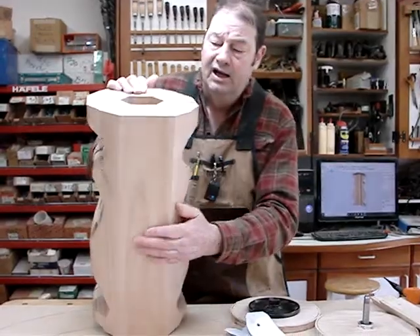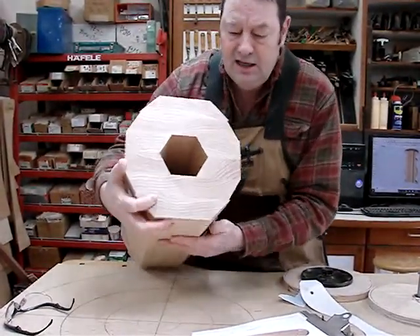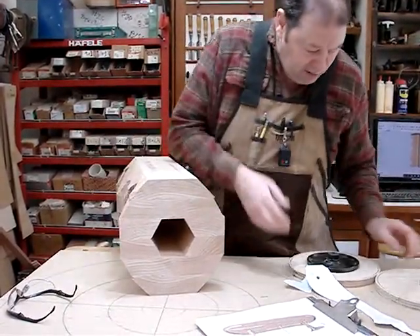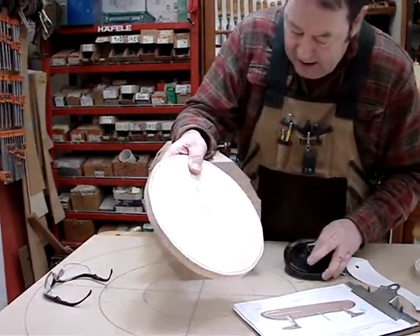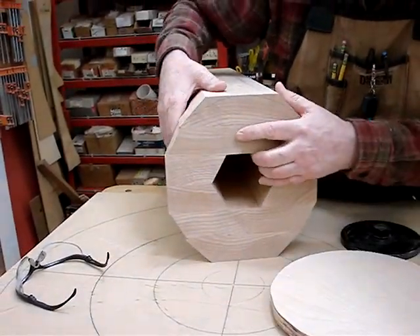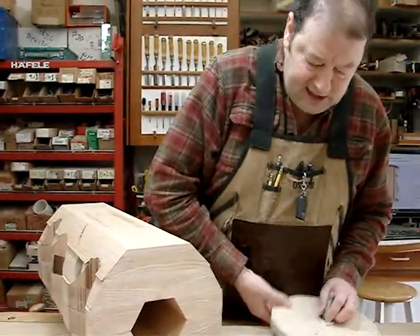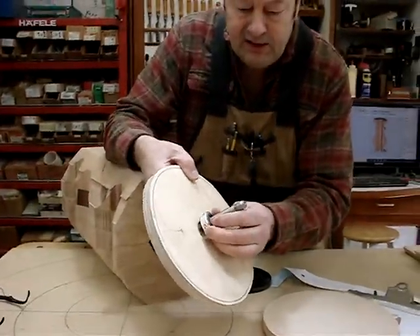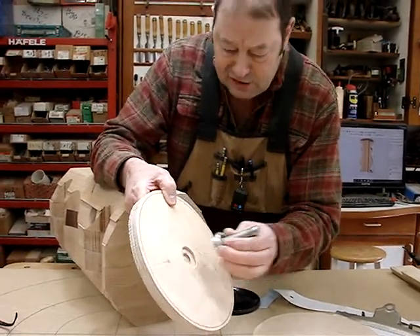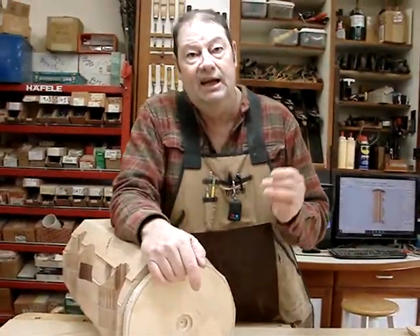To also chunk off some of the wood, I set my table saw up at 45 degrees and cut these corners off. But you can see it's quite a bit wider here than here. So I'm going to have a faceplate and screw this on very precisely — that will hold my two halves together along with the dowels. On the tailstock end, I went ahead and made another plywood disc to receive my live center for the tailstock, and this is going to screw this end together.